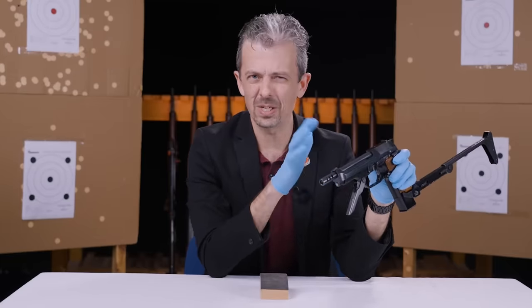There's another aspect - much better seen on the app - but there's a cutout on the bottom of the slide, and this pivoting piece here has a humped feature that engages with a curved feature on the underside of the slide. As the slide comes forward, there has to be something for that to rise up into on the bottom of the slide to allow everything to move. So they've had to make some significant changes to the design.